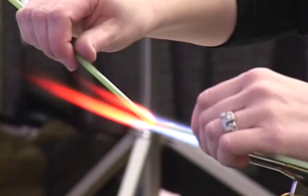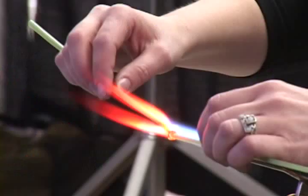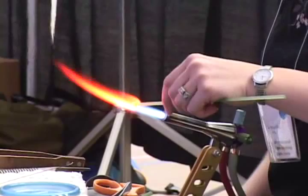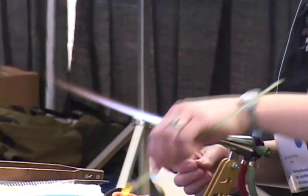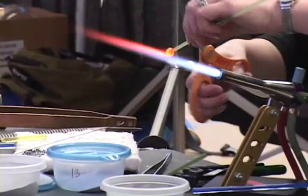When you're putting the larger pieces in the annealer, you're starting from cold and ramping up, right? Yeah, I start in a cold oven and then bring them up slowly. Usually 5 hours I think is good, but recently we were making the cupcake orb chalices, and the bits were breaking off the bird. We think we were bringing those up too fast for the amount of glass that was there. So for those, I've been really extending the schedule, bringing them up very slowly.